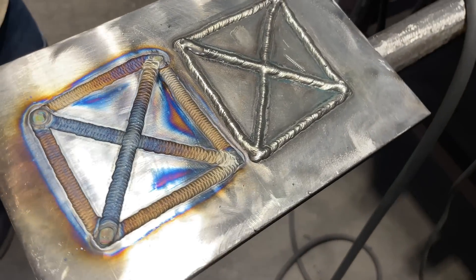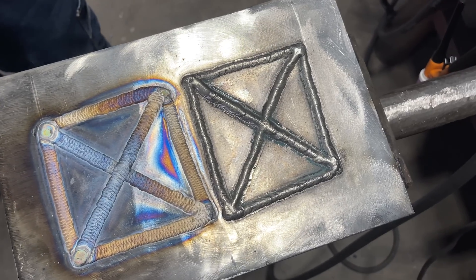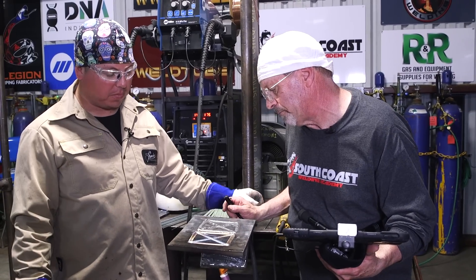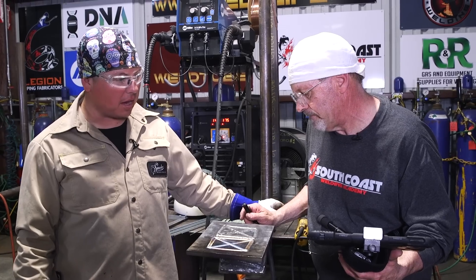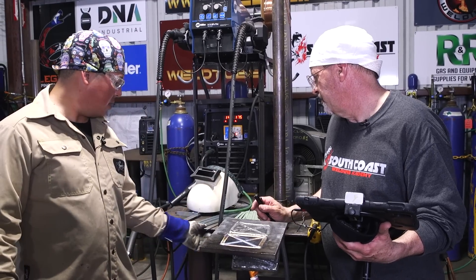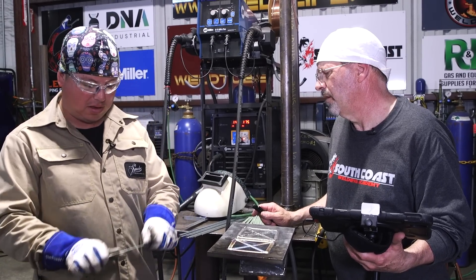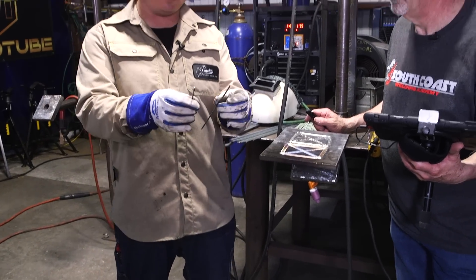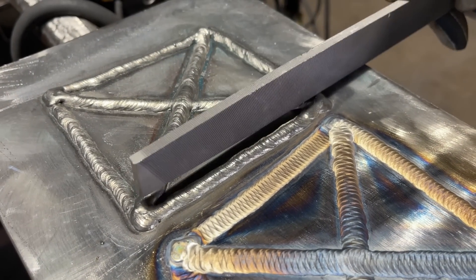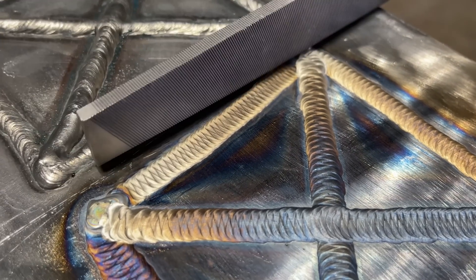Not only do you have the iridescent colors in there, it's got like a skin where it's solidified — that is slick. The wire looks dirty on the outside, apparently it's not — it still welds. Is it brittle? Yeah, very brittle, very hard — you can't bend this, it just snaps. So we're going to let this cool off and do the file test on it. Once it cools off we can check it with a file and see how hard it really is versus the base material, which is just a regular carbon steel plate.